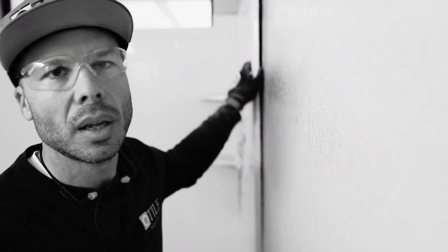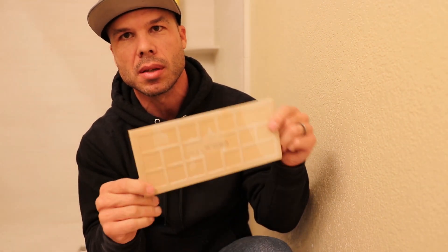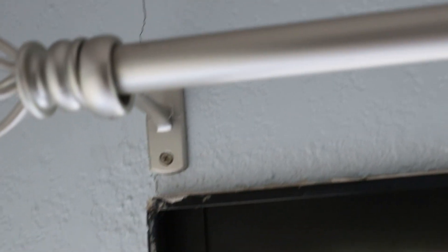What we've ended up with is a gorgeous shower. This was actually seven days of labor for us to redo, plus the material and all the tile. The first problem was that our one-coat float didn't bond to the wall and came loose and started to crack. The tile we used was also very soft — this is a four-by-ten, and watch how easily it snaps. If there's anything going on in your substrate, you don't have any leeway. Things move. We are on clay soils, expansive soils. This is an exterior wall, so it heats up and cools down — expansion and contraction — just another factor that can lead to a job issue.